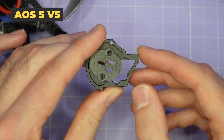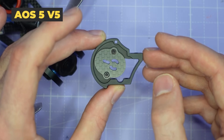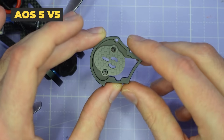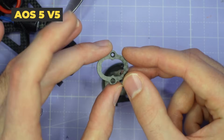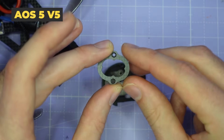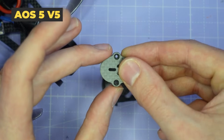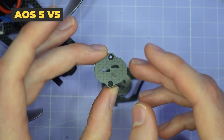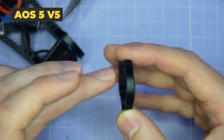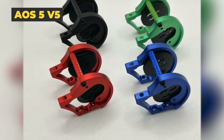This custom 7000 series aluminium camera cage is designed to be super durable and super versatile — not just for all the FPV cameras we use today but also for any new cameras cooked up in the future. It's got removable and replaceable carbon fibre panels for camera mounting with a few different options provided. The first is a soft mount panel that can be used with either a silicone or TPU gummy for soft mounting the O3 camera or Walksnail FPV cameras. A second carbon fibre panel stacks on top and provides hard mounting for standard 19mm FPV cameras. The cage provides full ND filter support for the DJI O3 system, and both sides are identical so there's no left or right handed version. CNC Drones are also providing this camera cage in a range of fancy colours.